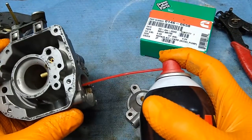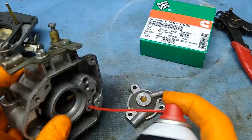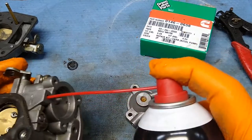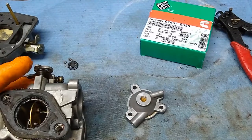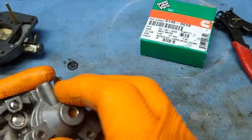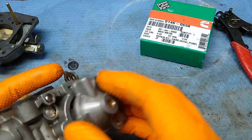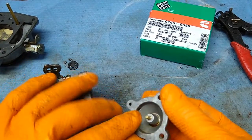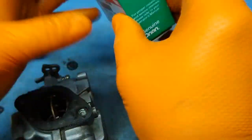When I spray through that hole it gives me a visual cue that we're in good shape. This shows me a nice straight spray pattern, meaning it went through all the internal operations of the accelerator pump and then out through that hole. So you get the kit.